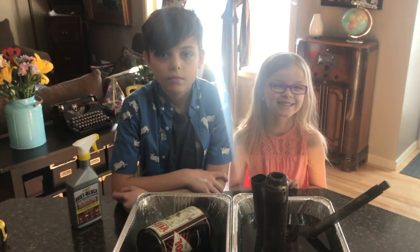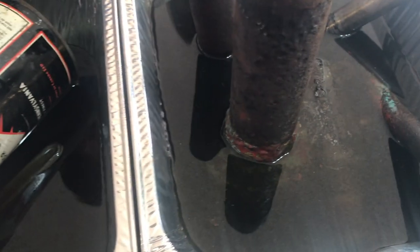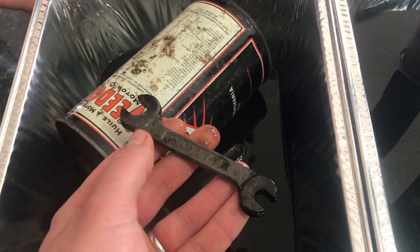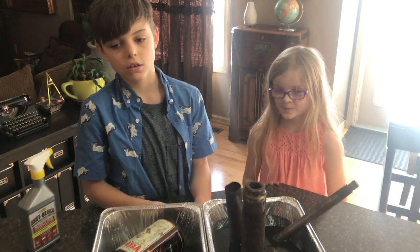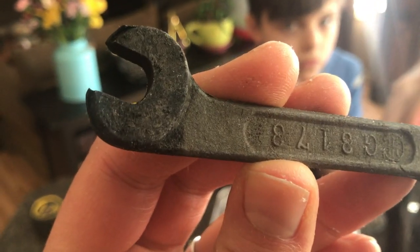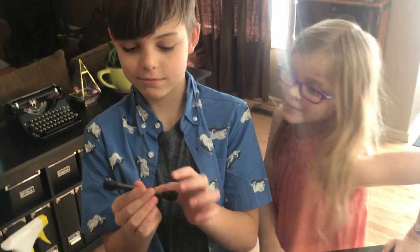It's the next morning and I've got my two loyal testers here with me. Does it look a little bit different, that liquid? Yeah, it looks dirty. Normally you can reuse EvapoRust, but I have a feeling the stuff I put in there was so rusty that I don't want to infect the other good stuff, so I might not reuse it. Let's take it out and have a look. Jason, this was your wrench that you said probably wouldn't come out. It's kind of a gray color — let's wash it off and see what it looks like. This is the one that was completely red and rusty before. The rust is all gone now. It's turned into a light gray color and you can actually read the writing on it — there are little numbers. I didn't even realize there was writing on here. So that came out pretty good.